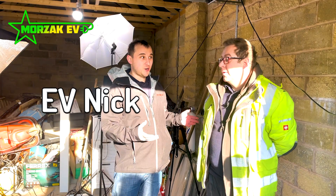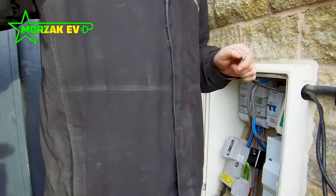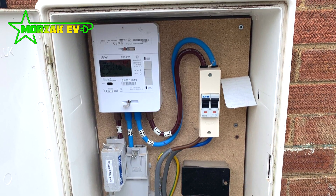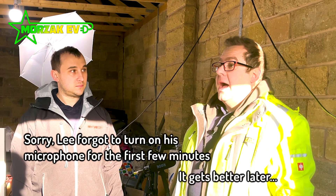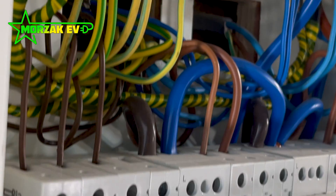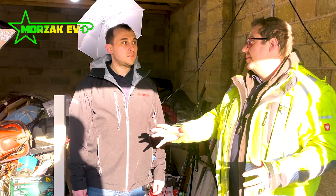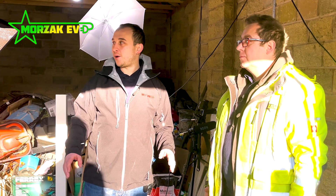Lee, you've come to my house and I've told you I want battery and solar. The first thing you do when you come to a job - what do you look at first? We want to have a look at your DNO cupboard - the main cupboard over there - that's where your main incoming fuse and electricity meter is. I want to check electrical bonding: water pipes, gas pipes, oil pipes, bonding for incoming services, which is standard for most electrical work. Then we'll take a look at your existing consumer unit and where you want the installation itself to take place, and obviously anything in between where the cable is going to be running, so we know what cables we're going to be using and the installation methods.